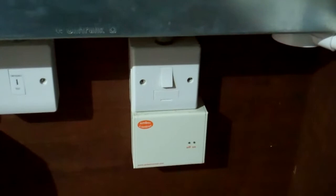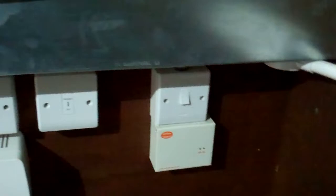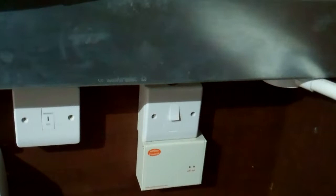Similarly on this side we have a frequency switch — the same idea, but you could set this one higher to 51 Hertz. When it gets to 51 Hertz it brings on this heat switch, which activates the contacts in here and brings on the radiant heaters — up to 3kW at a time. That's basically how it works; you just control it with a single switch. This time of year we don't need it on because there's not enough power, so you can have either the hot water on or the heat on depending on which switch position you choose.